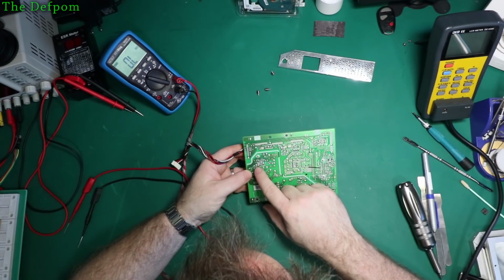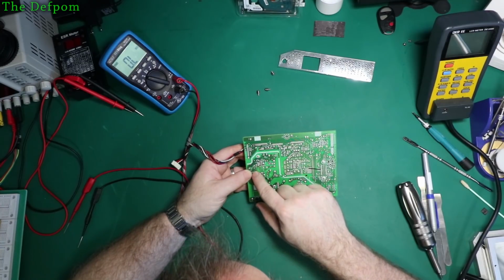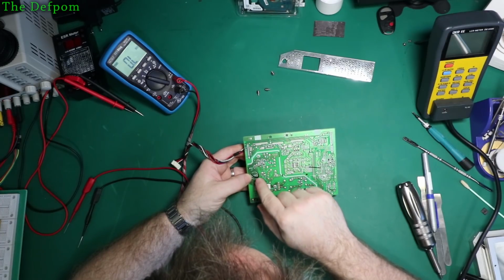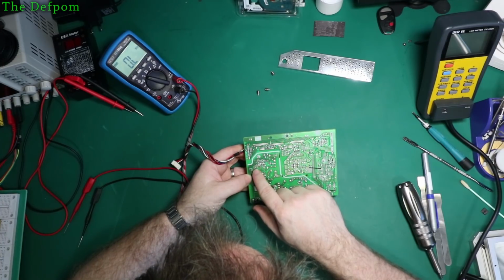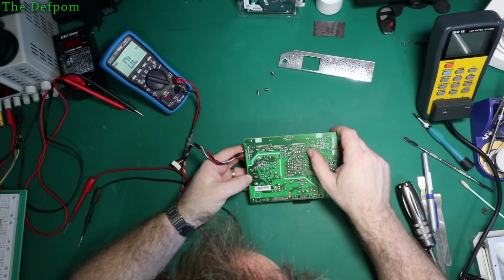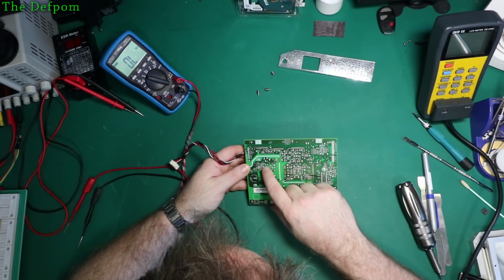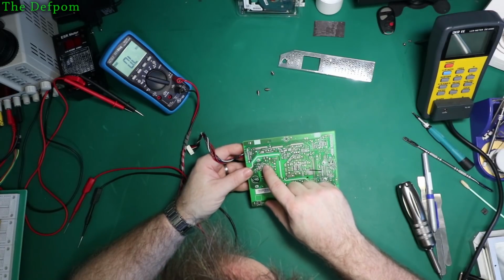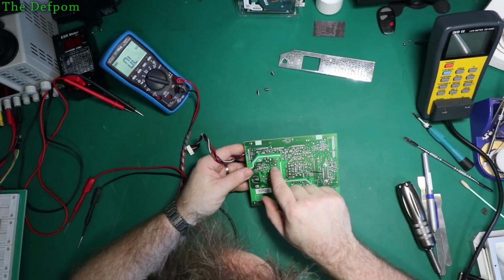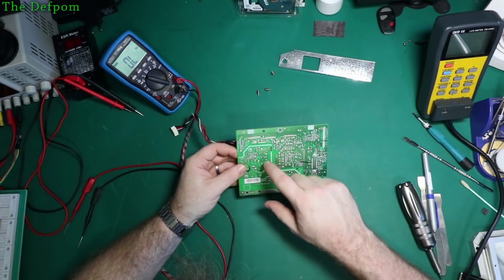So we've got negative chip, capacitors there, feedback there, also a couple of feedback, which is a positive smoothing here, capacitor across there. So that's a Zener diode, I can see it's marked as there. Okay. So it's obviously power supply. Yeah, so that's a higher voltage. So that's clipping the input and setting a voltage maximum there. So it's pulling this up through a Zener in order to drop the voltage. Okay. I'm just not sure that the input side's right either, that's the problem.